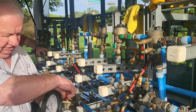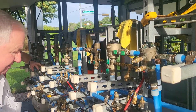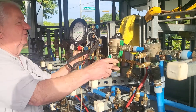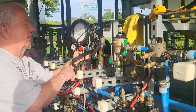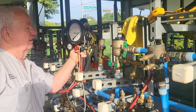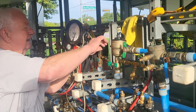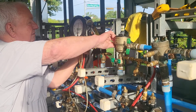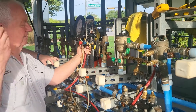All right. Now, what did I tell you what's going to happen when we're flushing this? I'm going to fill the top of this assembly with water. Hold my gauge to the level of my vent valve — it's going to get nice and comfortable. Close shutoff valve number two. Close shutoff valve number one. Now I'm going to lower my pressure by opening my vent valve. The gauge started to descend. Take my vent screw out. 4.0.